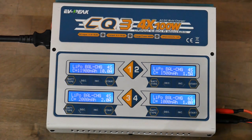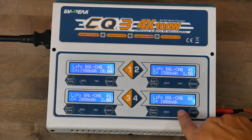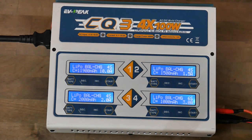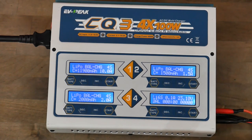If I wanted to charge this battery a little faster, I'd press the button to get into the amps setting and increase it to three or four amps. Also, regarding the C rating: it doesn't have to be exactly a round number. I don't have to go to exactly three amps — if it's 3.3 amps, that's not a big deal. Hold start, confirm, and it's charging.